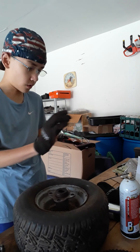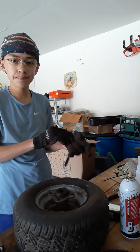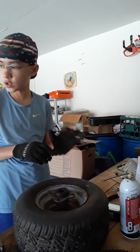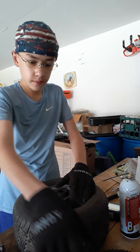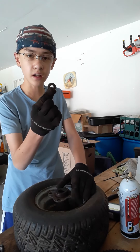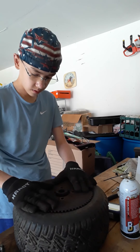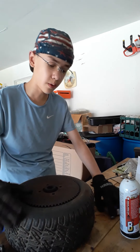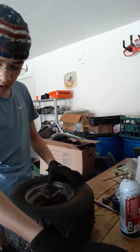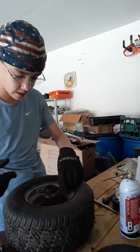So now I am going to assemble the drive wheel. I took it apart a while ago and didn't film it. I found all sorts of garbage in the wheel — there's water in both rear tires. The previous owner stacked a lot of washers to get the sprocket the correct distance from the wheel, because when it's just sitting in there, there's no way to put a chain on it. For now I'm going to start stacking washers because I don't have any other real solutions right now.